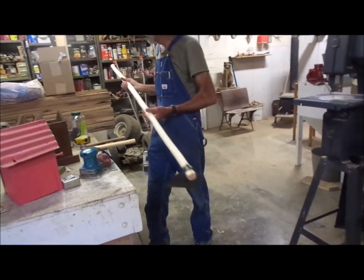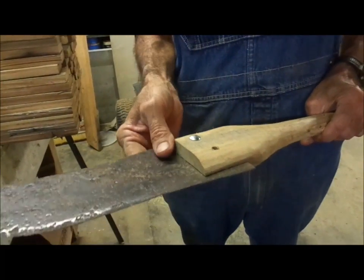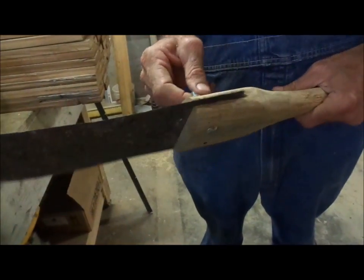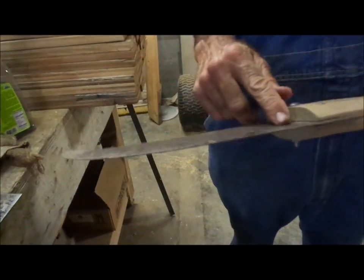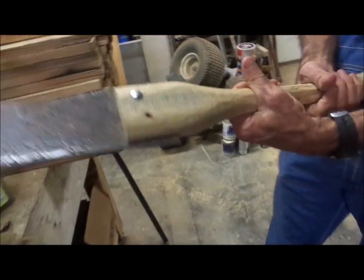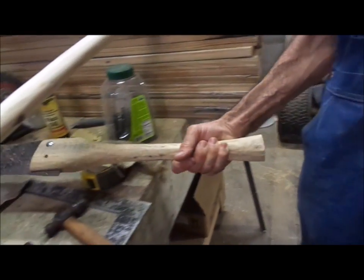So we've got this one done and the two hammer handles. What we've got here is an old Kaiser blade that was on a Kaiser and it got broken off. I took it and made this handle for it. I drilled a couple of holes in it, put a carriage bolt in it — I've got to put another one in, just didn't have it, need to go to town and get one. I've got to sharpen it up — things were laying out in a field and I found it with a tractor when I was disking. I figured I'd just bring it to the shop and make something to cut weeds with. I can cut sugar cane down, cut weeds or bushes — sharpen this edge back up real good and I've got another homemade tool for the homestead.